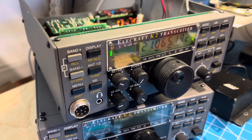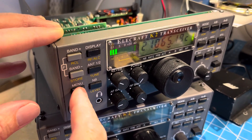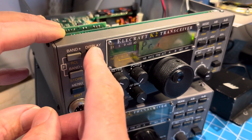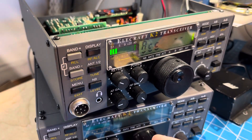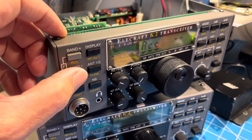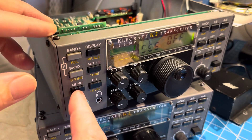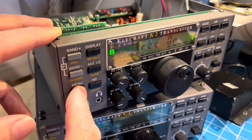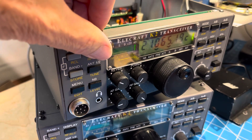Now that it's in, we have to enable it and then set it. To enable it, go into the secondary menu: push Menu, then hold Display. In the secondary menu, cycle through with the knob or the switches - switches give a little more control. Find RTC Off, press Edit, change it to On, then press Edit again to get back out. That turns on the real-time clock.